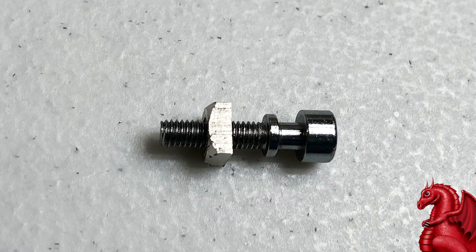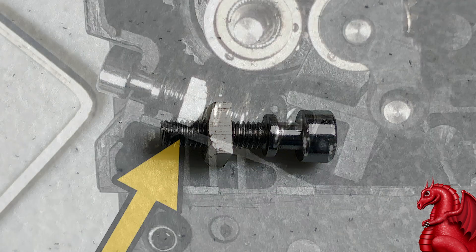To fix this, pull the screw and the nut out — you'll probably have to pull the screw out first since it's inserted into the spring a bit, then the nut will come out too. Needle nose pliers will help here. Then screw them together — and remember, your instinct will be to turn the screw to the right like any normal screw and nut, but with this one you need to turn the screw counterclockwise to the left to get it to insert into the nut. It works the opposite of every other screw you've used.